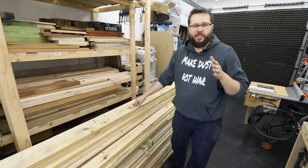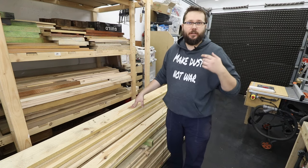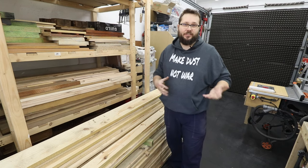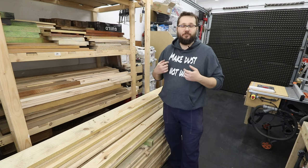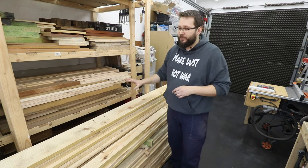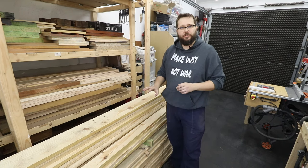The best wood you can pick for a planter project would be cedar, or even better Siberian larch. In most cases these types of woods are very expensive and hard to get, so I'm going with something totally different — something I can actually afford: mainly pine. I got it from a sawmill; it's rough sawn, dead cheap, but it will still serve its purpose.